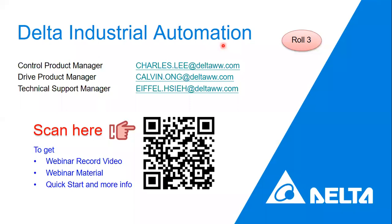Next one is, can we convert the DOPB program into a new HMI with DOPSoft 4.0 versions? Yes, absolutely. We compile all the B series programs within the new 4.0 versions. No problem. Next one is, DOPB had a function previously using the eServer to collect the data to PC. Is DOP100 also still compatible with eServer? Is there better software to collect the data from HMI? Yes, right now we still support the eServer. And we also support the FTP function. I think if you already use eServer, it's very functional.